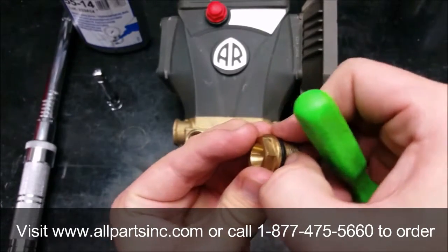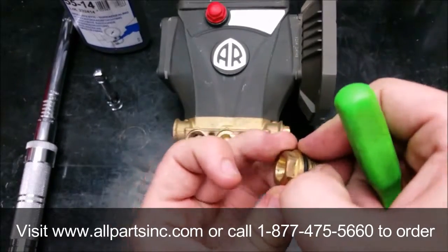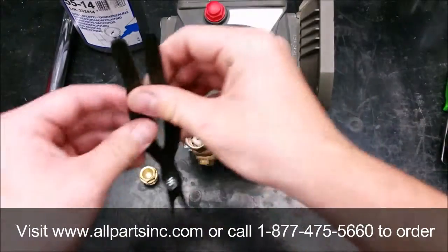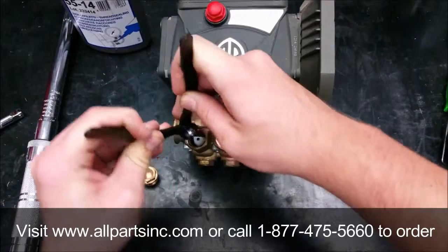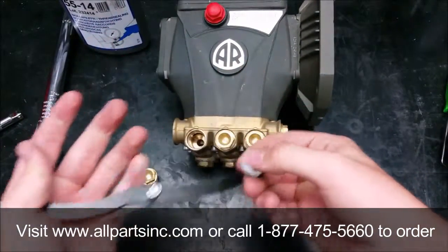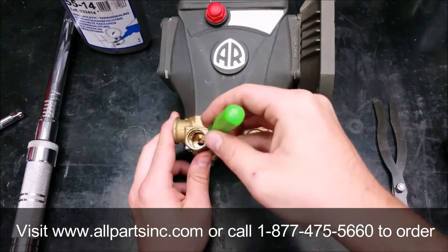Using something sharp to clean the O-ring may pierce it. It would be best to use your thumbs. Next, using a pair of reverse pliers, remove the valves by grasping the plastic valve cage and pull straight out. Clean the threads of any debris.